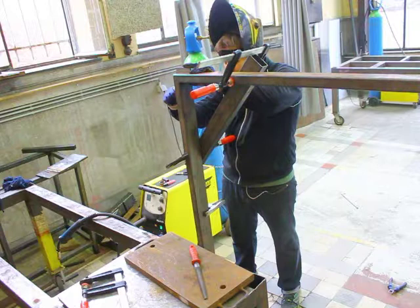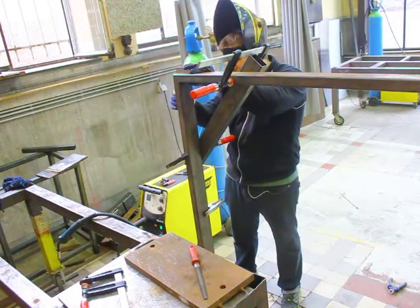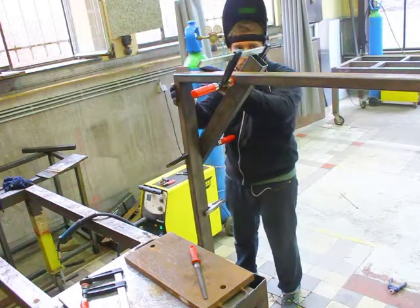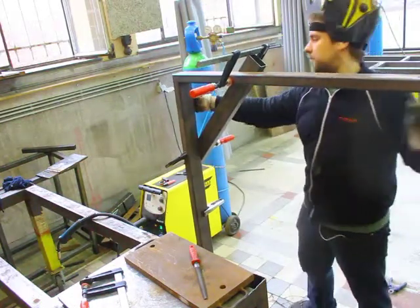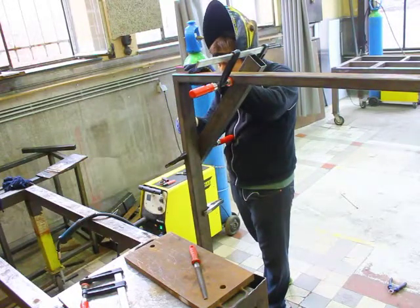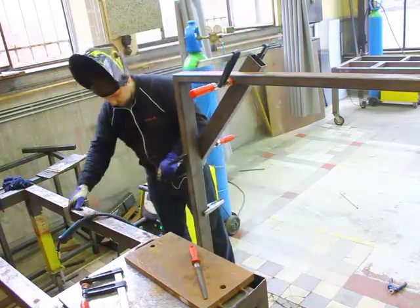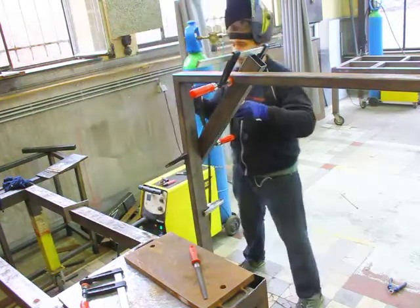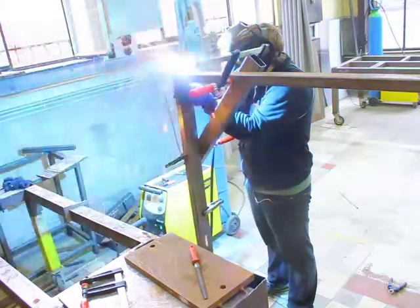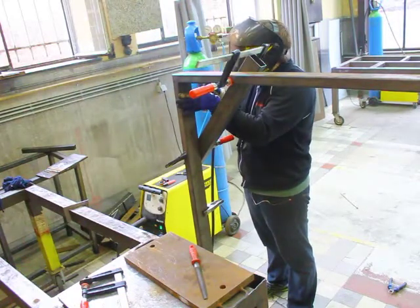It's beneficial to have a heavier but also stiffer CNC router table because in the end it's going to give you a more consistent result — you can expect the same or similar result every time. The goal of the machine is actually to have an accuracy of 0.1 millimeters or less, which is four thousandths of an inch.